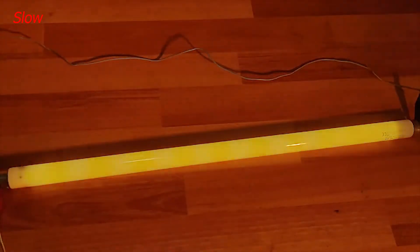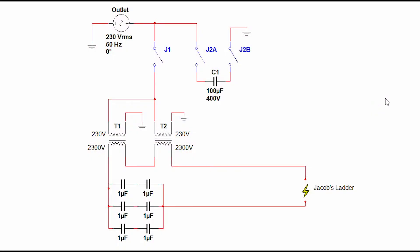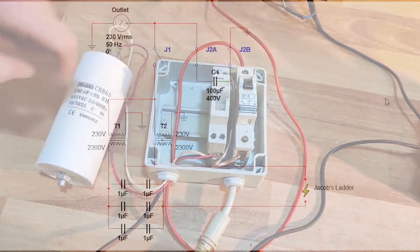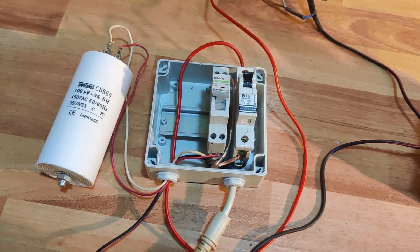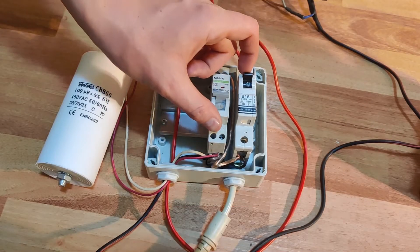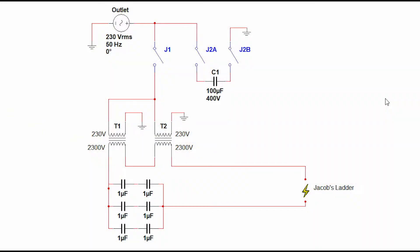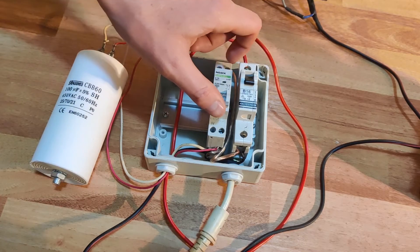Here are some safety precautions I have to take between each sequence of making this video. Starting with the basics — powering up the circuit. First I need to supply the reactive power by connecting the C1 capacitor to the grid. Then, clearing the area and powering up the transformers. Now the tricky part is powering down the assembly. Even after disconnecting both breakers and unplugging it from the outlet, it is still not safe to handle, because each of these capacitors can store a dangerous charge for many minutes after disconnecting the power supply. So, in order to discharge the big cap, we close both breakers for a few seconds, such that the current can dissipate through the primary windings.